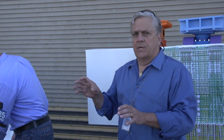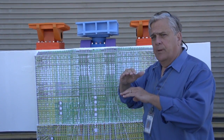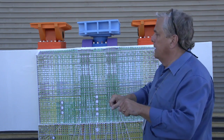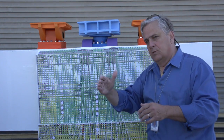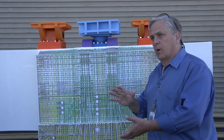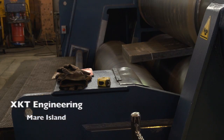We've broken the saddles up into the upper saddle and the lower saddle. When you go inside the shop, you will see a lot of U-shaped pieces that are independent layers of the upper saddle. Some of those layers have notches — those notches are the troughs where these cables will be run, going through and pulled around through the ducts into the anchorages. You'll also see some smaller pieces with a slight curve — those are the lower saddle pieces. You'll see the upper saddle in layers, the lower saddle in layers, and a few other odds and ends associated primarily with the lower saddle.